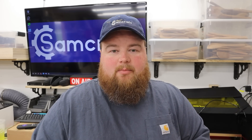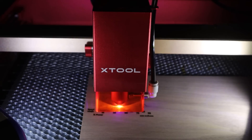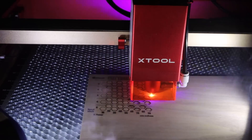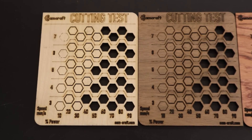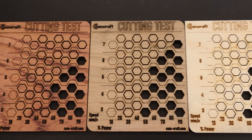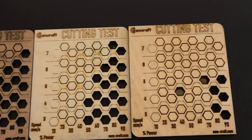With a diode laser like this, there are a ton of different materials you can engrave and cut. For my material tests, I did cutting tests with wood and plywood, and engraving tests with slate — these are the two medias I do 95% of my work with. For the cutting test, I went through a variety of X-Tool stock including maple, cherry, bubinga, walnut, and plywood at 1/8 inch or 3mm thick. The general consensus was I could run as fast as 7mm per second at 80% power and get a single-pass cut through on all the 3mm woods. For true Baltic birch plywood at 3mm, same result — 7mm/s at 80% single pass. The 6mm Baltic birch plywood, notoriously difficult, the X-Tool did it at 5mm/s at 80% power. Very impressive.